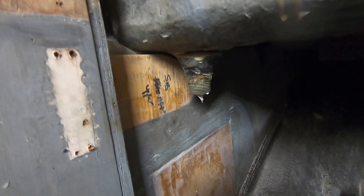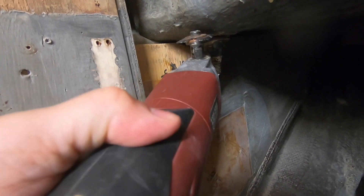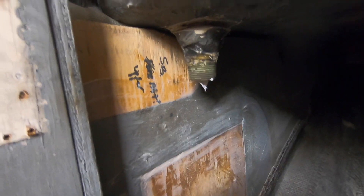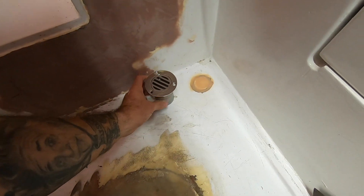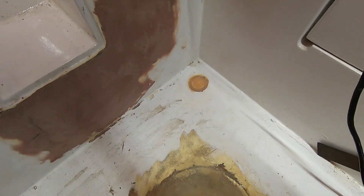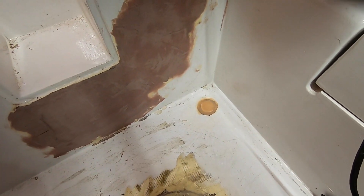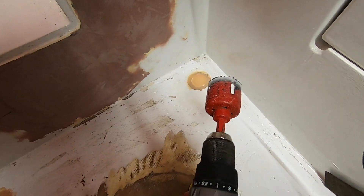The cockpit drain pipe is going to come from here down to the new through hole. I need to get rid of this old one and put in my new two-inch cockpit drain. I've already taken an oscillating tool and tried to get this out of there, and it's really not working well. New plan: this is the new stainless steel 316 cockpit drain that's going to go in the corner there. Instead of trying to cut that out, I put some paper towels in to block off the hole, then put in some thickened epoxy. I need a two-inch hole for this, so with that epoxy in there and a two-inch hole saw, my theory is I'll be able to drill that out.